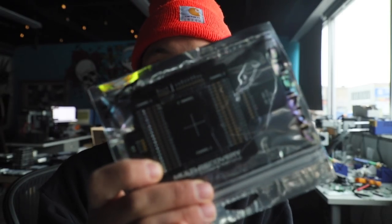They will need to be wired up, and using an adapter that has NAND protocol on it and SD protocol on it makes it very useful for pattern recording. We can record the pattern using the SD protocol of the adapter and then read the NAND using the NAND protocol on that same adapter without having to switch devices. And what that will lead us to is that by writing a pattern into a fresh working device, we can then extract XOR and find out if there is any arrangement of how these blocks line up, using something that we can have manipulation over.